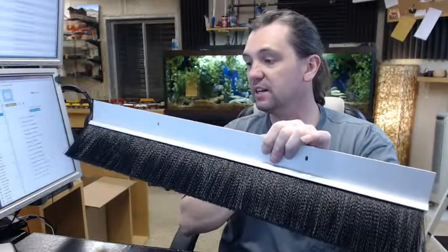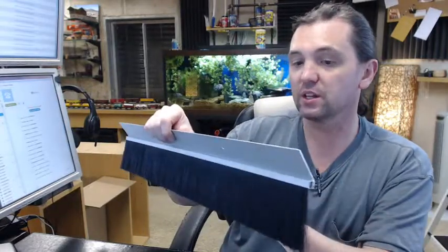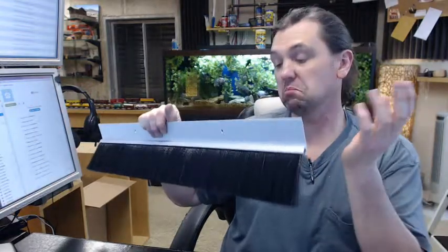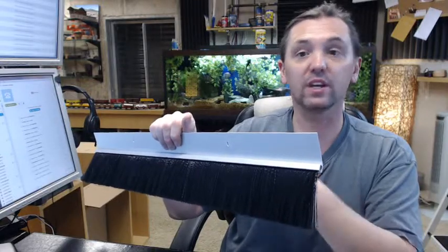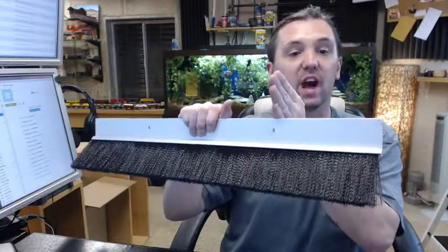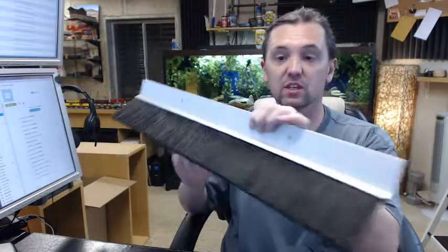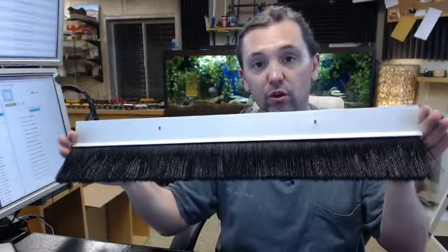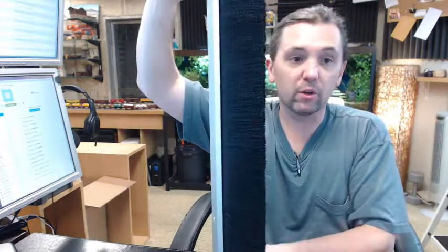A client needed to seal a very small area in a larger situation they were dealing with. While this is a short example, imagine if this was 48 inch and you had to cut it down to 40 inch — well, you would eliminate that slotted hole here. That slotted hole is nice to have because it gives you all that ever-important critical vertical, or if you are using this as a jamb on overhead doors, lateral adjustment.